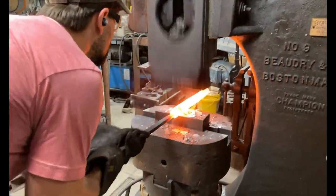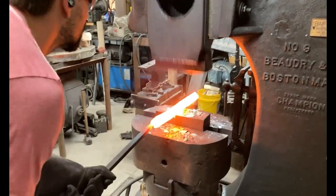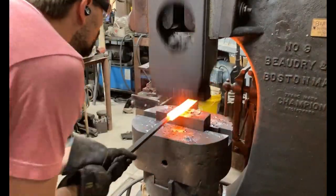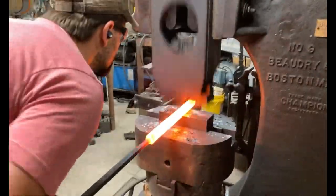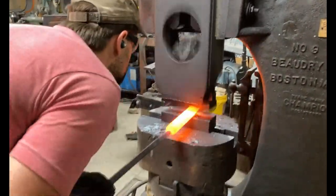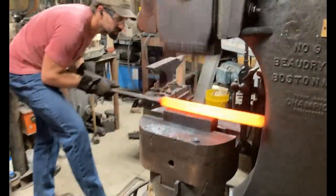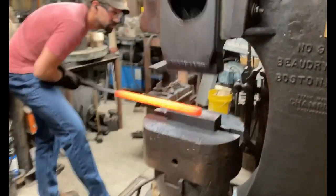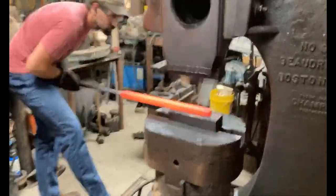Now we're going right into our 45-degree re-square — partial re-square — buckling C's to start making our W's. I'm re-squaring it to octagonal at a 45-degree angle so I get good corner wrap on my C's. Then I've flipped it the rest of the way to 90 degrees, crushed down that C, and now I'm just getting a long, thin, even bar for my restack next time around.